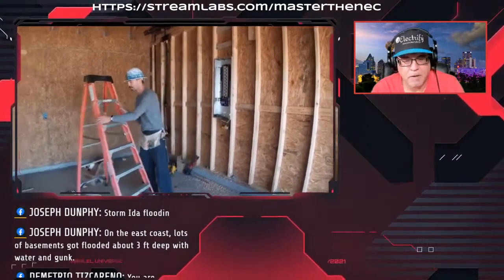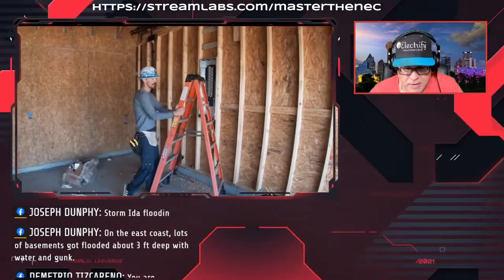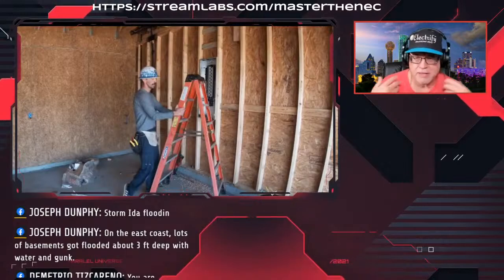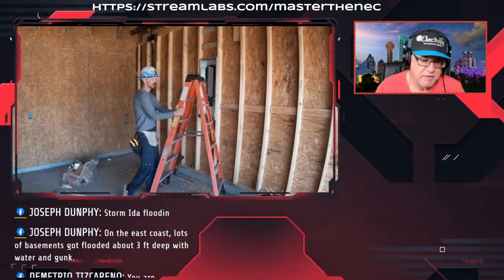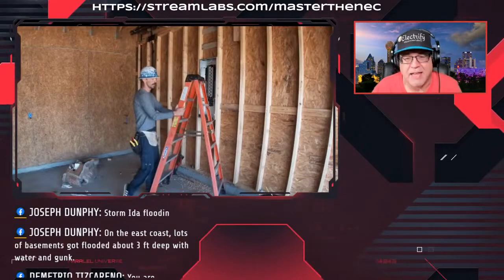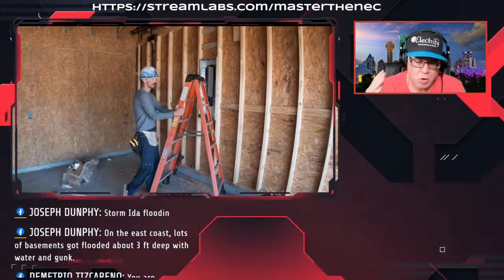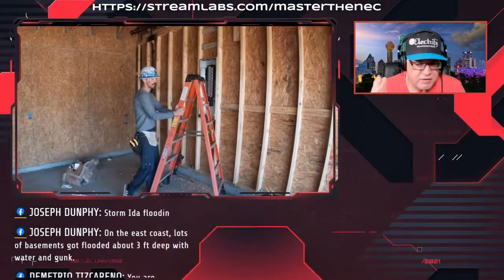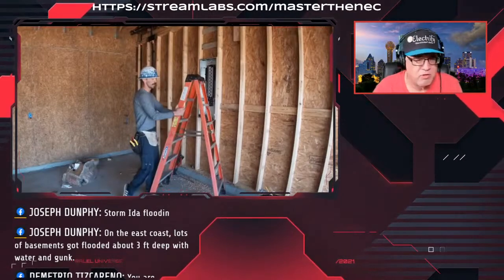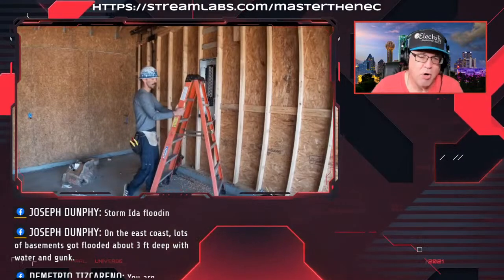So just an insight to him. This is by no means our recommended way of doing this. For example, I do it totally opposite from him. I don't run the home runs first. I like to lay out my rooms, lay out my circuits, and identify where my home runs need to go, so that I know what receptacles and what lighting circuits are all going to be on each run. Then I identify which receptacle or switch location is going to be my home run, and I mark it. That's where I take my home runs last.